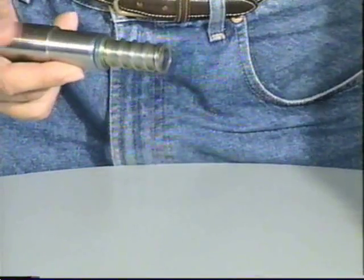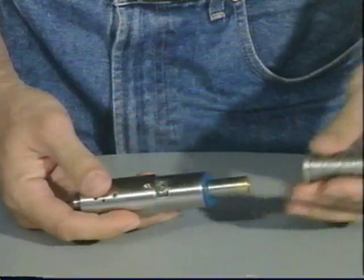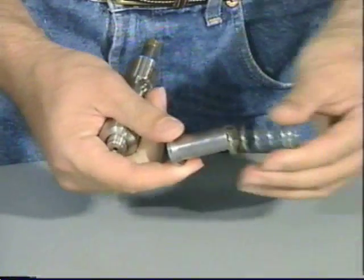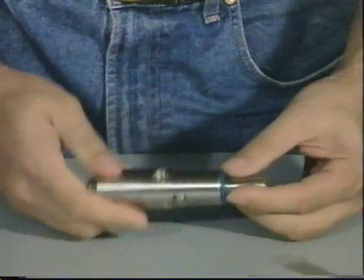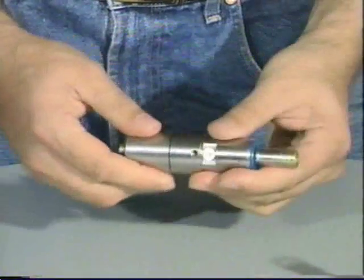The valve is basically three simple pieces. The first thing that will come off is the bolt assembly, and the spring sort of sticks on the bolt so you do not drop it off into the grass. The next thing you can do to take the system apart is unscrew the regulator body on the back from the valve body.